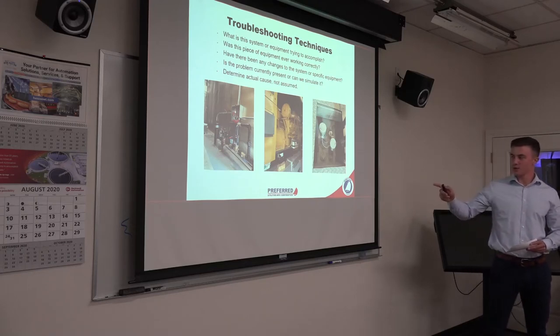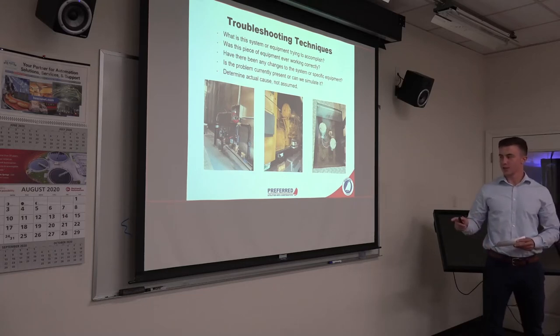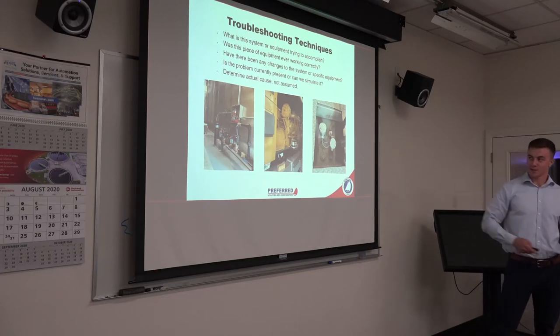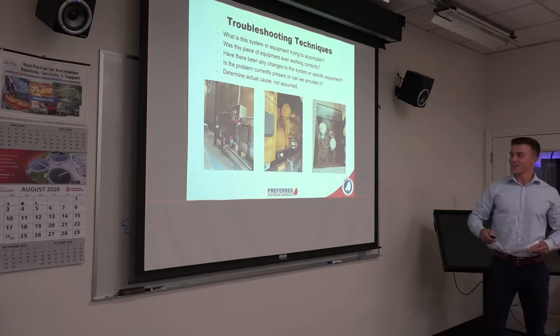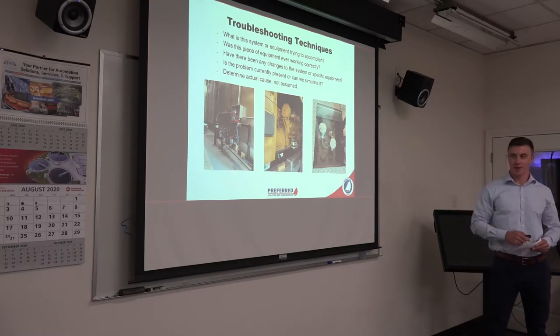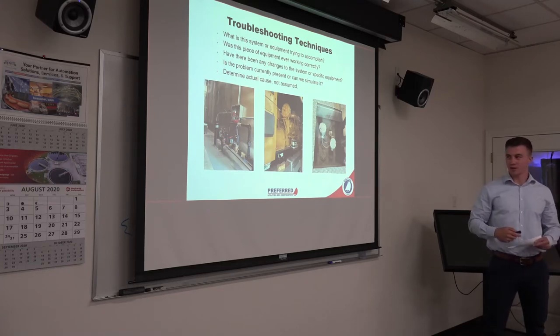Here we have MIT Site 5. They had two emergency generators on the roof that they were installing. It's a new building, and we were doing the controls for the day tanks up there. They had a lot of problems, so I probably asked these questions to myself like 30 times. Their pumps were only coming on in manual, not auto, and they thought it was our controls not sending a call to the pumps downstairs.